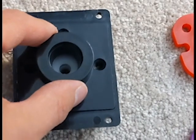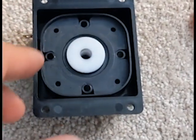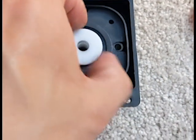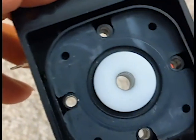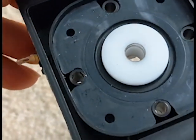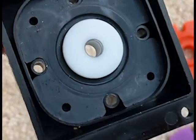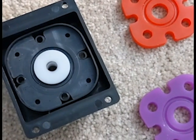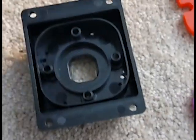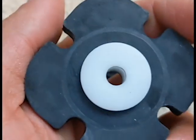You can go ahead and take the top off and inside you'll see the stock rubber grommet. It has a hard tension, about 45 Shore A. It doesn't come out on its own very easily — you're going to have to use a flathead screwdriver to sort of pry it out. Once you do, you're going to need that white core.